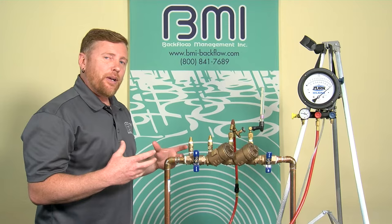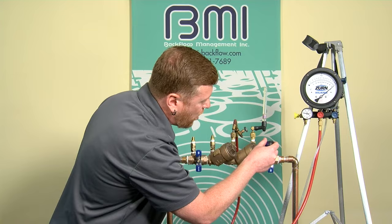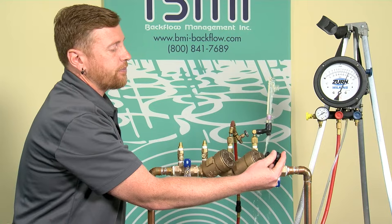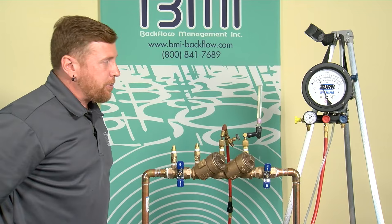I've got the same scenario — pressure on the front side of check valve two looks roughly over 40 psi, around 45 psi. When I open test cock four, I'm actually flowing water across that check, allowing it to open. Water flows across the check, but if the check is healthy, it's going to close and hold at least one psi on the front side when downstream is open to atmosphere. I'm opening test cock four slowly but fully. You can see my gauge needle descending — the test cock is fully open. I'm patient and waiting for the water to stop running, because continuous flow may indicate a shutoff leak.